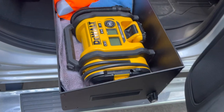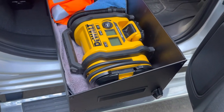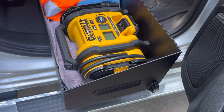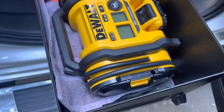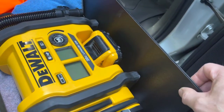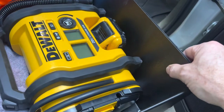I'm really disappointed though that it's not working very well based on some design issues. First of all, the thing is super noisy. It's made of sheet metal with a powder coat on it. It slides on plastic rails that slide into aluminum grooves, so it's not like it's on ball bearings and it certainly isn't supported on the front or the back — it's just sliding on the bottom, which means it rattles around a lot. The inside does have a plastic tray on the bottom, but I had to use some Lowe's Cobalt brand tool drawer liner on both sides just to make the thing a little quieter.